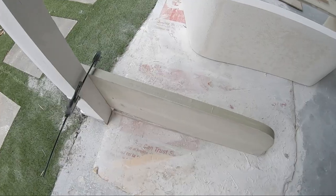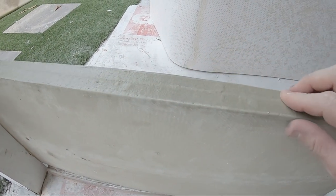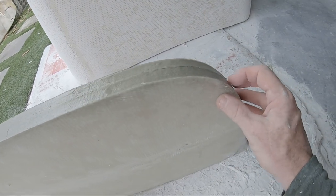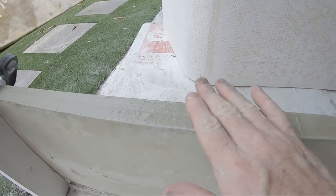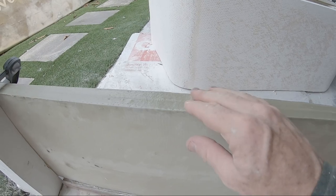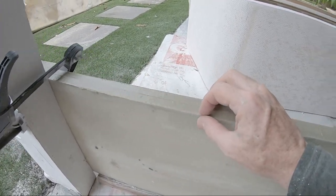This is coming out really good — it's pretty solid, definitely solid enough to sand, but needs a little more time to cure since epoxy takes a lot longer to set up. I'll come in with the DA sander, sand it smooth, maybe do another skim coat to get it perfectly smooth, and then use the router to put a radius on the edge. That's a wrap for Sunday — going to clean up before the girlfriend freaks out about the mess, and I'll see you next week.